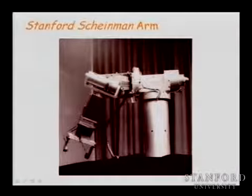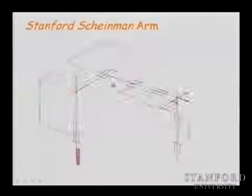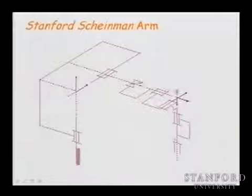And if you extend it completely and rotate your joint 6, joint 6 and joint 4 will become aligned. That is, this joint and this joint become aligned if you rotate this up and make the two joints parallel. This is a special configuration, a bad configuration. We call it kinematic singularity. Because when we move this joint up and the two are aligned, we cannot rotate anymore about this axis. We are locked. It's called wrist lock. This happens when joint 5 is equal to 0.